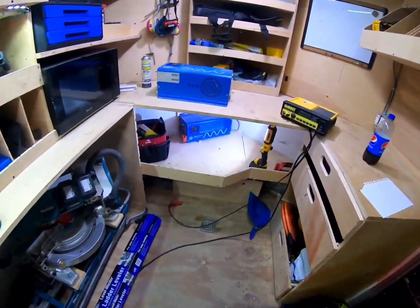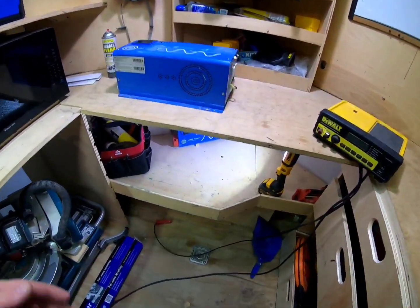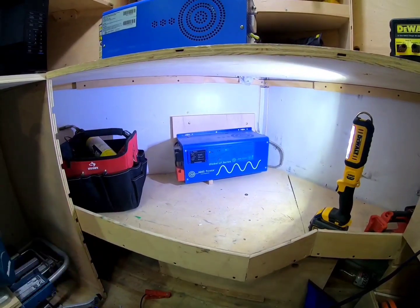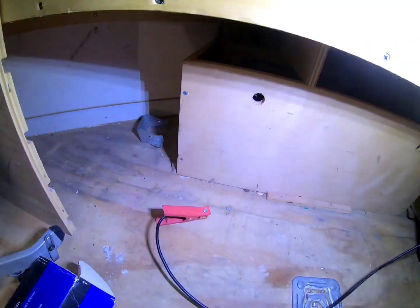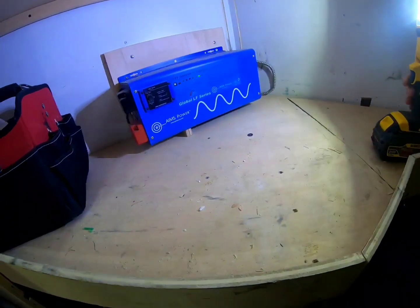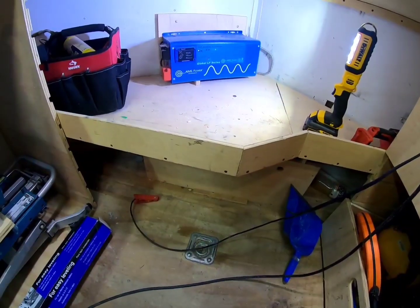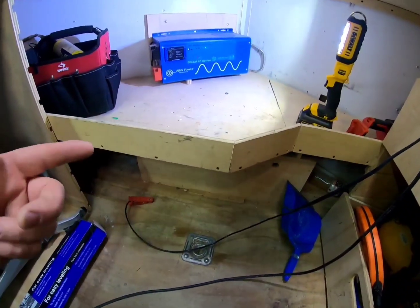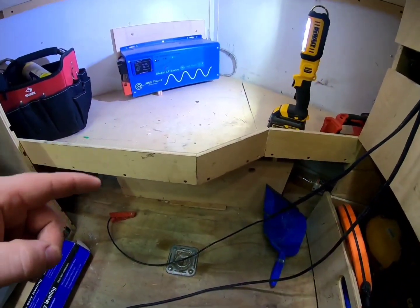Let's get into my system — why I like it and the pros and cons. I have an inverter, actually two — one's my spare and one I actually use. It's screwed to a board that's screwed to the studs with a shim, because these things weigh about 60 pounds and I don't trust the shell to keep it up when bouncing. Battery bank: I've got four deep cycle batteries wired in parallel — four 12-volt batteries that become one big 12-volt battery with combined amp hours. Each battery is 115 amp hours, so four in parallel gives me a 12-volt battery at 460 amp hours.